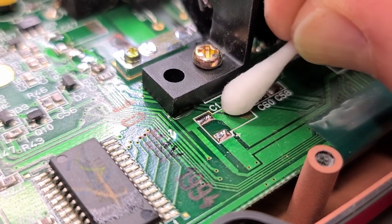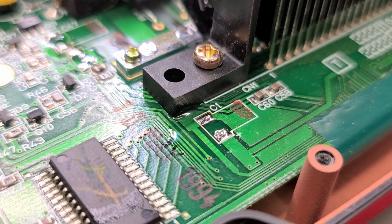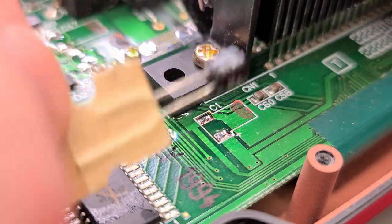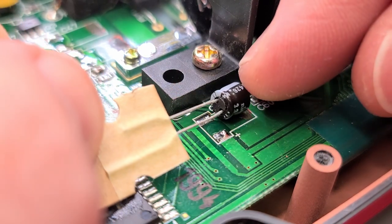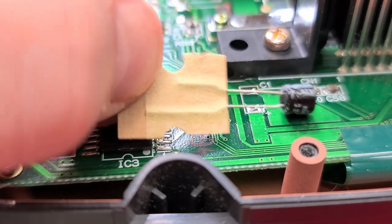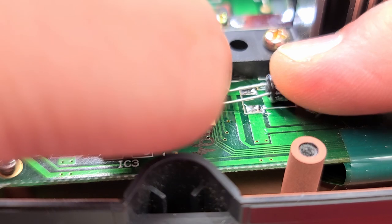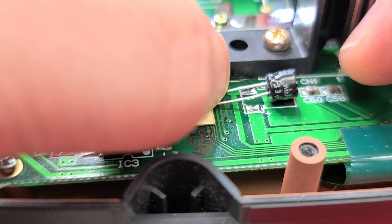I have been trying, although not too aggressively, to clean off this glue adhesive that was holding the cap cover to the board. Being that this is not my Game Gear, I've decided to leave well enough alone and not scrape away at the glue on the top of the PCB and move forward with just attaching these caps. But how to do that?